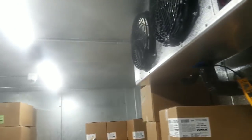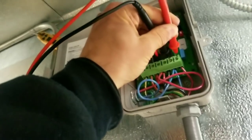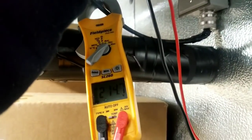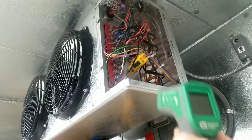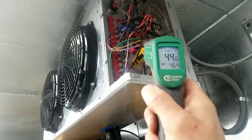With a coil that's obviously clean, I didn't expect it to go this long. We are 45 minutes into our defrost: 62 degrees in front, 114 degrees behind the coil. Double-checking our termination switch — X and neutral — it is still open, so the termination switch is not trying to kick us out of defrost yet. I have my defrost time set to an absurd amount like two hours just so I can see what temperature this termination switch kicks us out. Surface temperature is getting to about 44 to 45 degrees, so it should be coming out soon.